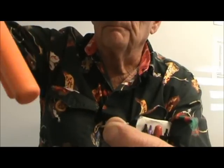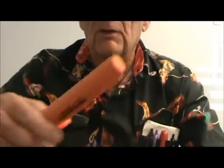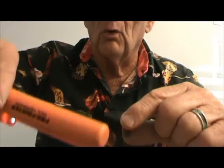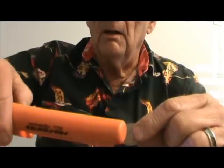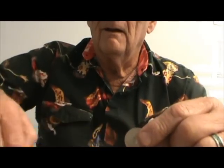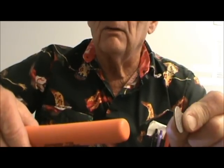So when you're down in a hole looking for it — how do you get it out of the detune mode? You just point it away from anything metal and punch it once. Now it's back to the standard mode where it'll detect things about three inches away. So if you're in the hole looking for something you can't find, push the detune button once, and now when you get close to it, it'll beep right there. To put it back into regular mode, just punch it once and you're back into standard hunt mode.